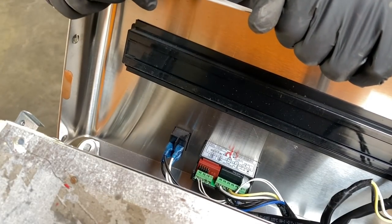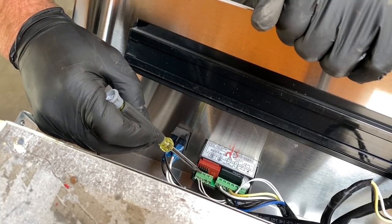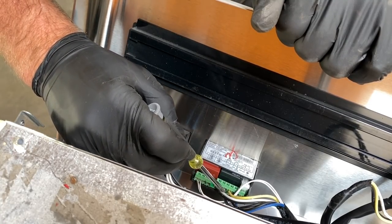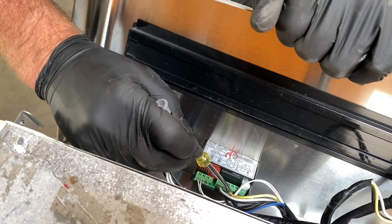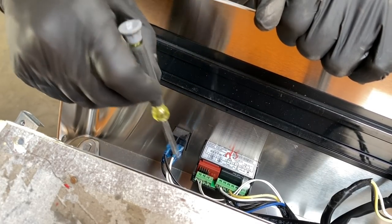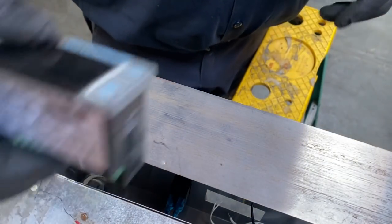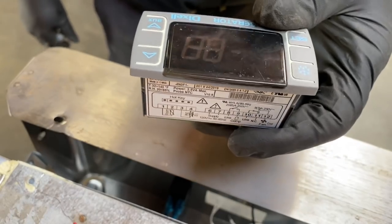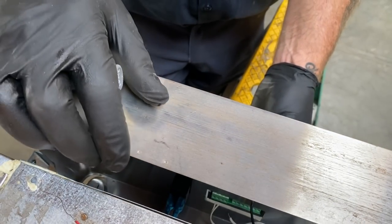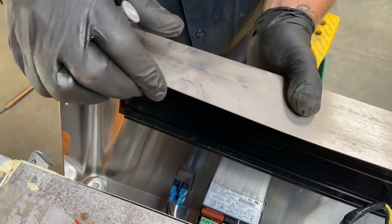That's pretty much it. I got my two sensors, wires, hot to fire it off, hot compressor, hot evap fans. That's basically it. And then to put it in, you get your new one. Slide it in through the front. Look at that, all nice and pretty.